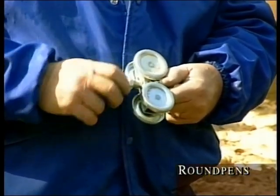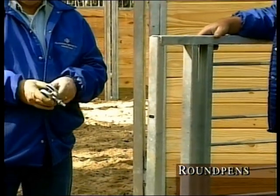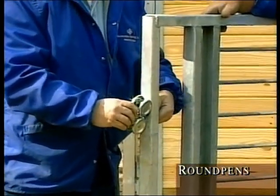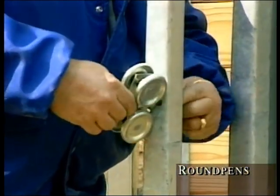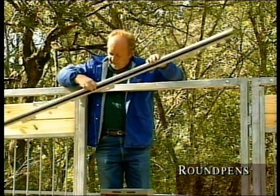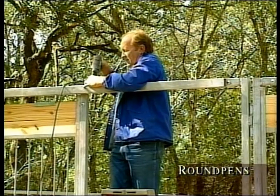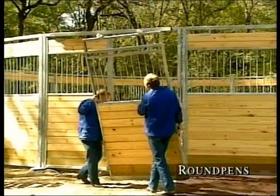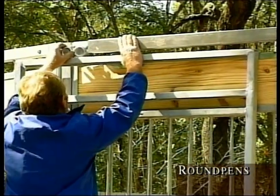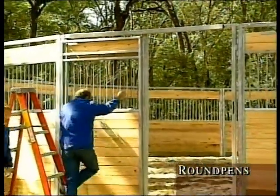Now you are ready to attach the rollers to the door. Screw a nut onto the roller stem before sliding it into the slot on the top of the door, then screw a nut onto the stem on the other side. Each door requires two rollers. Next, mount the track on top of the top tubing of the door wall, slide it up to the head of the carriage bolt on the door wall, and screw it into place. Once the track is secured, you are ready to hang the door. Slide the rollers into the track and roll the door shut. Adjust and tighten the top locking nut down onto the top of the door, securing the rollers into place.